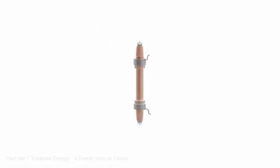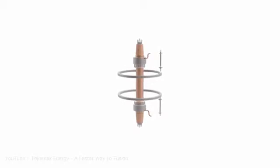These are the divertor coils. They shape the magnetic field so that excess heat and particles are diverted to a strengthened area of the machine where they can be removed. The merging compression coils will be used to start up the plasma by creating the plasma current that the solenoid will then sustain. Merging compression is where the energy will come from to achieve the 100 million degree temperatures.